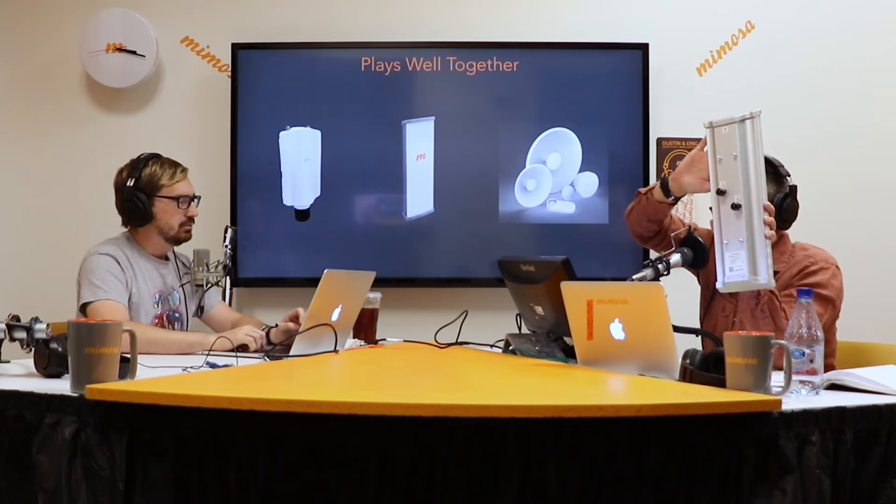Do you have an N545X2? Here's our X2 dual port. That brings us to an important point: you need to have the proper cable connection. You go to RP-SMA to N-male jumpers and that'll get you connected. When you take the A5X, there are no provisions to clip it onto the Mimosa panel antenna, so you'll have to mount it with a pair of pull straps. Please note the A5X does not come with hose clamps — you'll have to provide your own. It does not come with a PoE either. It's 24 to 56 volt, so you have plenty of options to choose from.